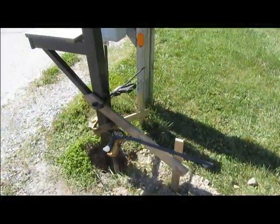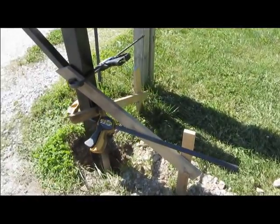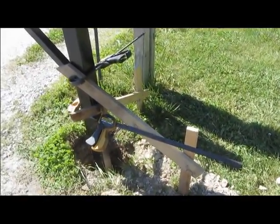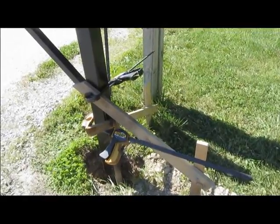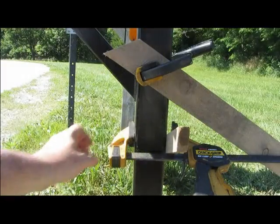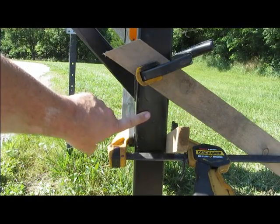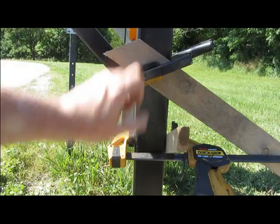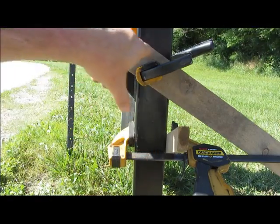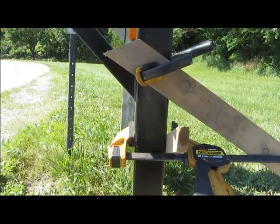Just a quick review of what I did: I took a couple of stakes, staked them in the ground, and made them secure. I then screwed cross members to them, and once I found level on the post, I secured it with clamps. As a side note, if you were installing a wooden mailbox post, you wouldn't have to use clamps — you could actually use a screw and screw the supports into the post itself, and that would work just fine.